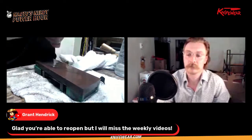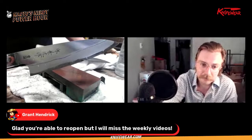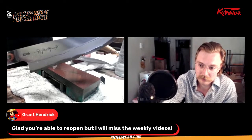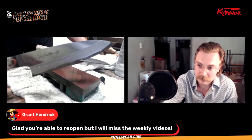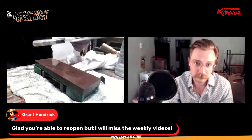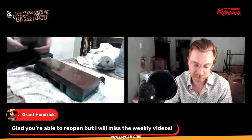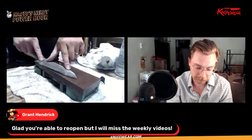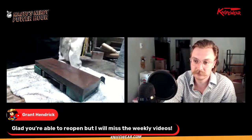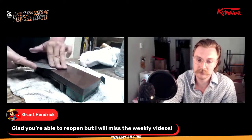Like I said, this particular knife, the true bevel is at this drawn line, and there's a fake bevel on the top. The true bevel is where it's actually being ground, and they use sandblasting to make a straighter bevel. Sakai also uses this. Even if it looks really clean, often Sakai uses a metal piece that goes on top of this bevel, and they use the stones to polish it. So it is yes and no.